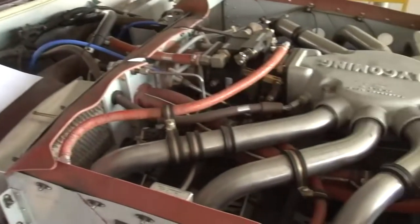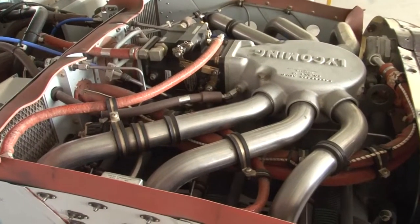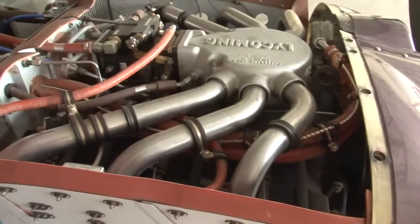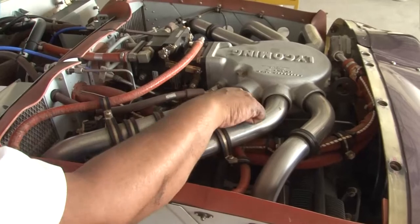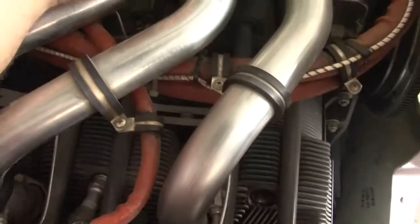Then in general, as part of your 50 hours of inspection, we need to inspect for evidence of oil and fuel leaks. We will inspect the complete engine for any oil leak, for any fuel leak around the cylinders, just adjacent to the hold down points here, the base bolts and nuts. You can see here the base